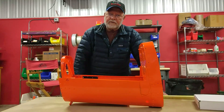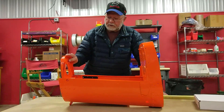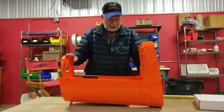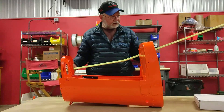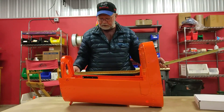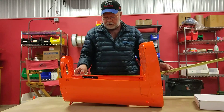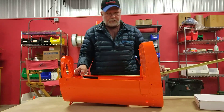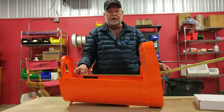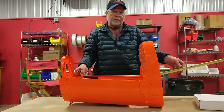SEL 55-1 covers the Cessna square tails through the CMO. They have the hockey stick — the dreaded hockey stick tube. This is the Cessna factory new hockey stick. It goes right here, and from here all the way out the end of this thing, this hockey stick doesn't do anything except protect you from oil canning the skin here by your grab down when you're pushing the airplane.